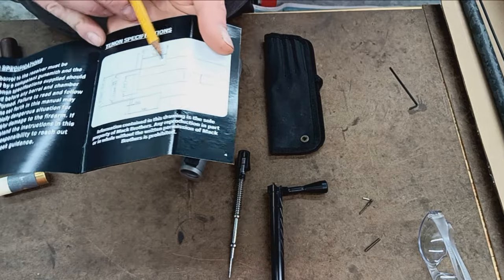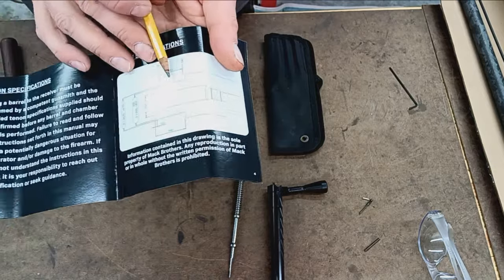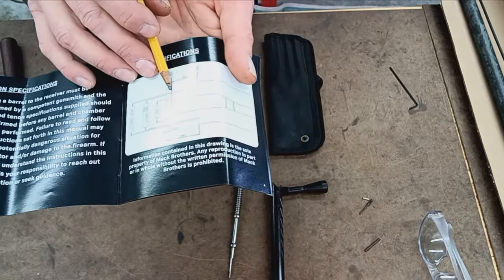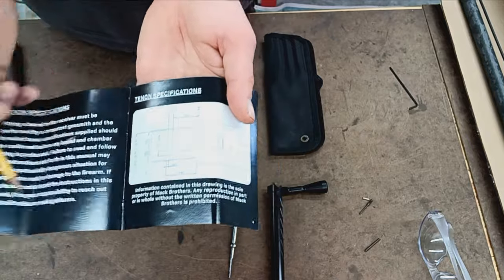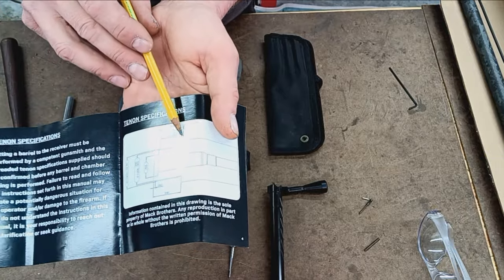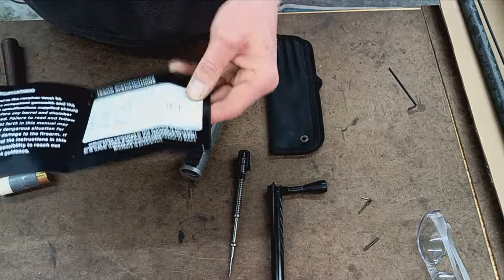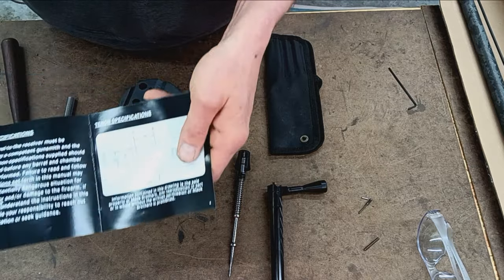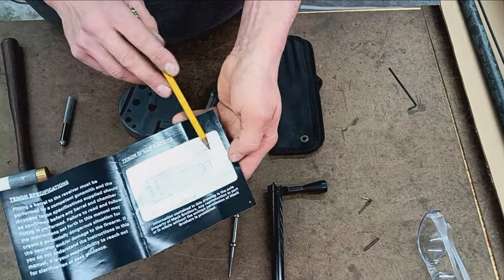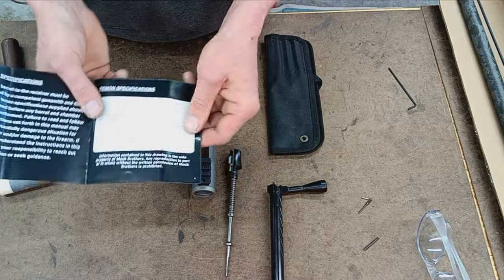So that's probably optional. Some gunsmiths like to cut this relief here so when they're threading down, they have a place to kind of stop reliably. If they're a little bit green on the controls or whatever, they can stop the machine here. I'm not going fast by any means, but I'm not going slow, but I'll just thread and pull the tool out as I disengage. So that looks nicer, looks more professional. And in this kind of situation, you don't need a relief groove there anyway. More steel. And the other benefit, if he shoots his throat out, we could back this up simply by picking up that thread, moving all these features back until we've got a fresh, clean throat there.